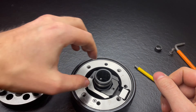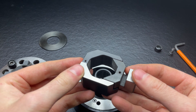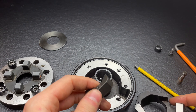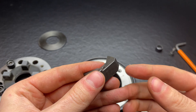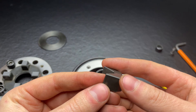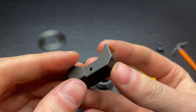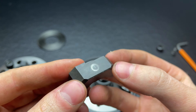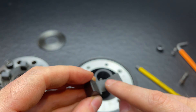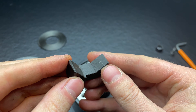This inner part contains two main components. This first one is a slider — it is quite simple, not ground but face milled on every surface. The screw pushes against it as it moves inward, and with these angled surfaces the two balls are pushed in to clamp.